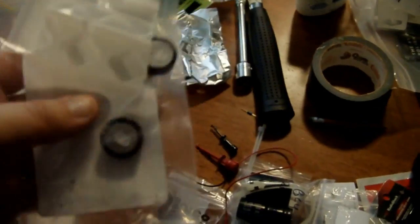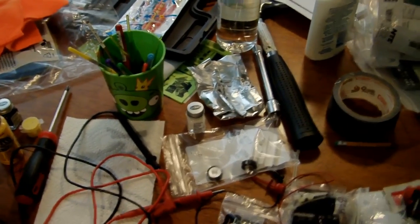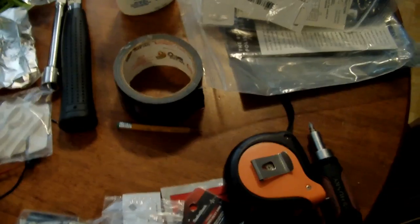The problem with the NiCad batteries they have in these old machines is that they will eventually leak, like any battery leaking, and it could damage the board. So the sooner I get that out of there, the better. These are those extra lights for the Pac-Maze that I bought. Now, I bought 2 of these, so we can ignore this one.